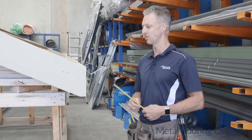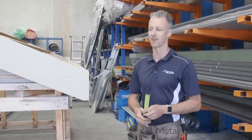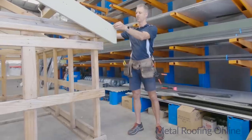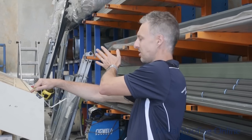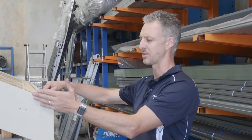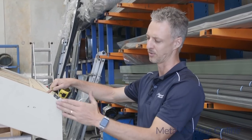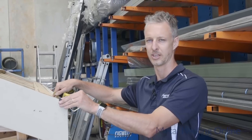The guttering I'm about to use I've got to cut to size, but we do sell the guttering in the size you're after — just let us know and we can cut it to length so you don't have to. What I normally do with measurements is measure from the outside of the fascia to the other outside of the fascia and then allow an extra 15mm. As I showed in the last episode on the quad gutter on metal fascia, I hang the gutter about 7.5mm past the fascia on both sides so that when I put the barge capping on it meets up nicely. You don't have to do it that way — you can make it exact — but I find it looks a bit neater.